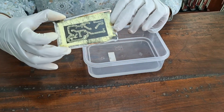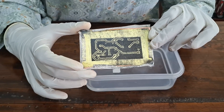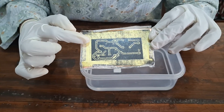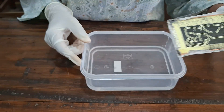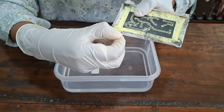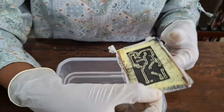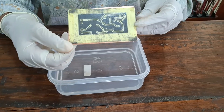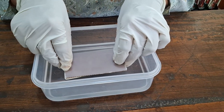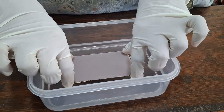As you can see, this shows the result after the ironing process. During the heating process, the traces are printed on the copper board. To check the result, we have to sink our PCB in a water cup to remove the sticker paper. Before doing so, we have to remove the tape. We can sink the copper board in water, and after a few minutes we can remove the sticker paper from the board.